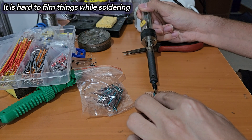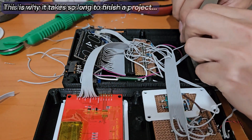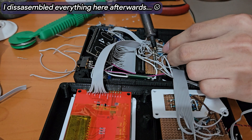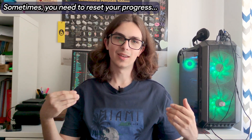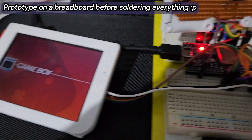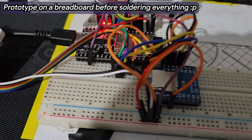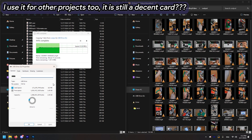I found that out after a lot of trial and error. I recreated the circuit multiple times to verify all parts worked, and tried directly soldering onto the ESP32 for the most stable connection — but the chip just restarted randomly. I tried different power supplies, different regulators, even different chips, but nothing worked. After a week of debugging I took a break, disassembled everything, rebuilt it on a breadboard, and randomly tried another SD card. It worked on the first try. Testing again with the old SD card, the random restarts returned. Even though that SD card worked fine on many other projects and showed up on my PC, it just didn't like the ESP32 — and now I know.